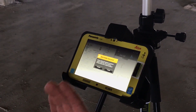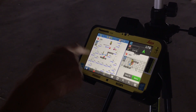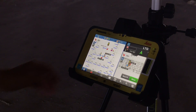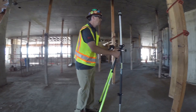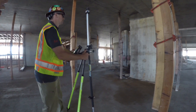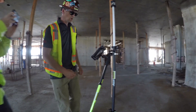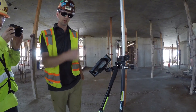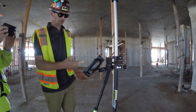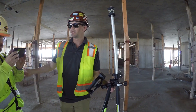It says it's out of tolerance by an inch in elevation — that's okay. It immediately sends us to the next point, which is left 17 feet and out two foot. We quickly get to that location. Once we get here, it says left one foot. We're not going to be actually able to stake this out because there's a piece in the way. But you would just go until you got to the location, hit Store, and continue to the next point. If there's something you can't stake out, simply select another point on the screen and physically move to that.